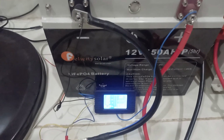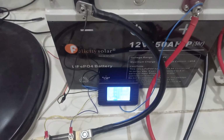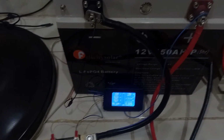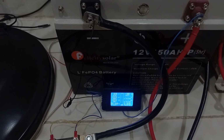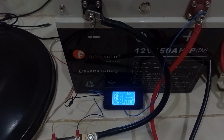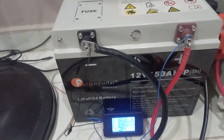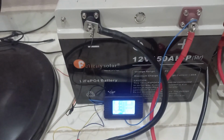I am not recommending you to buy or not to buy, but what I know is for this battery, the capacity that I pulled is 130 amp hours, and I know that I cannot do any reasonable discharge with it. I cannot do a 0.2C rating discharge, or sometimes even 0.1C. We can reach 0.1C, but not all the time. Sometimes it will just shut down.